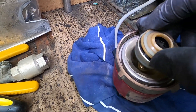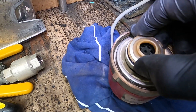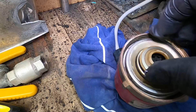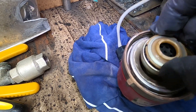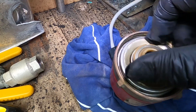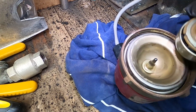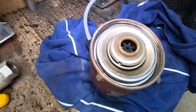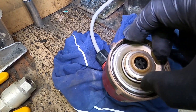You might be able to see that vibrating - there you go, you can hear it. So I've got magnetism but I've got no spin. I need to think about that because it could be the windings, but it could also be that capacitor.